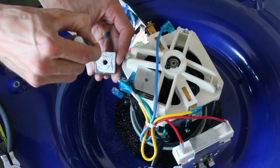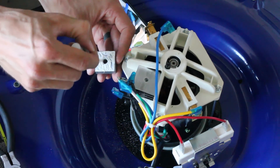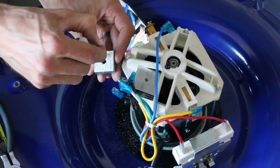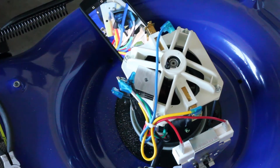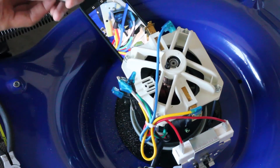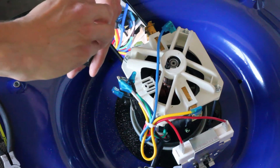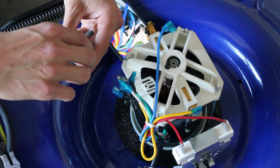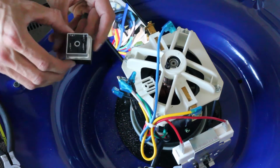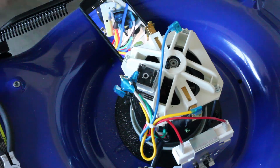Look at the entire surface there. Definitely overkill for what this is — it's a 50 amp bridge rectifier, 125 volt, so it's already more than enough. We have this great heat sink, and the heat sink is going to have great airflow, so this is going to be way overkill. Let's see — it's going to be an orientation like that, about like that. Then let's put that there, find our screw which we put right here.